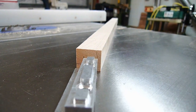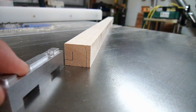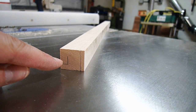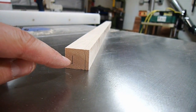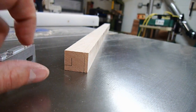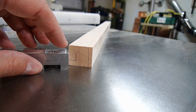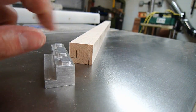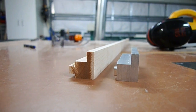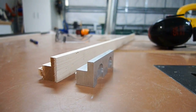I've drawn some reference lines — turned the piece upside down, laid it on there, and marked it out, leaving a little extra area to work with. The first cut is this notch, and I'm not going to cut right on the line — rough it out first, then come back and make a nice clean cut. The other line is the waste side, so we can clean it up to fit perfectly. There's also a slight height difference accounted for. I'm making the pieces longer so they fit down into the grooves. Here's a finished product — I just need to drill a recess and a pilot hole for the screw, then cut it down to size as needed.